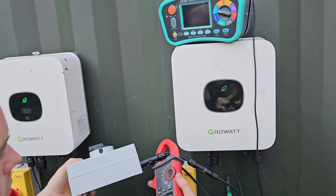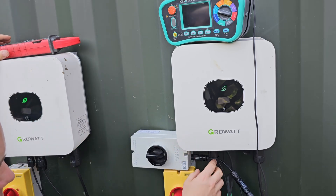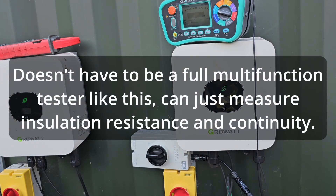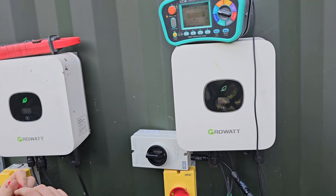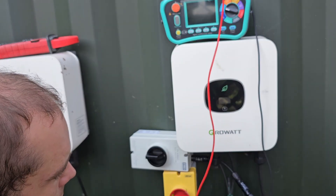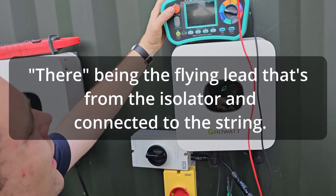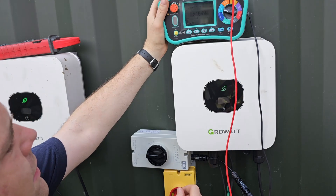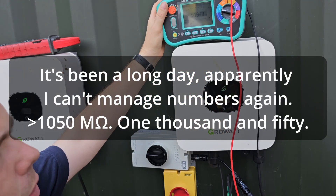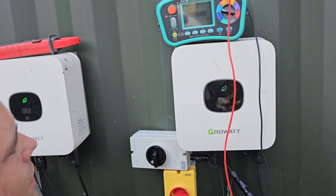That's reading 3 amps. Now, whilst that is short-circuited, we are going to come over to our insulation resistance tester. We've got that on insulation resistance - pop that in there, connected back onto the earth down there, plug that in there, and then we can run an insulation resistance test. It's coming in at greater than 1,500 mega-ohms. And that is how you do that test if you don't have the right equipment.